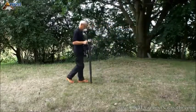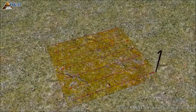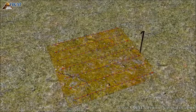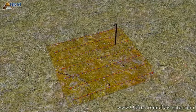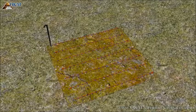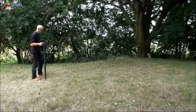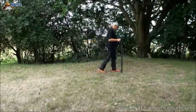Let's also see this procedure in more detail. We start on the corner and scan the first path. Now we step to the left and scan the second path backwards. And again to the left, scanning the next path. We repeat this procedure until we finish the scan. This procedure is for professionals only and not recommended for beginners or on hard terrain. It is absolutely recommended to repeat each scan in the same way with the same parameters — this is called a control scan, to make sure the values are valid.